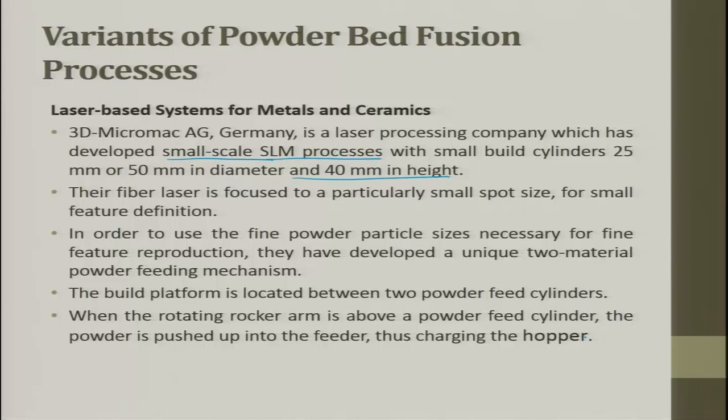Functionally graded materials can also be incorporated, making implants very sensitive to small deflections or changes in pressure. For ear implants, the SLM process is the primary process for making metal-based parts. This is rapid manufacturing — in one build on a 30cm × 30cm table with 2cm components, you can make 25 to 30 parts layer by layer simultaneously. When you finish one build cycle, you get an array of 30 parts. People are using this approach for rapid manufacturing of live applications.